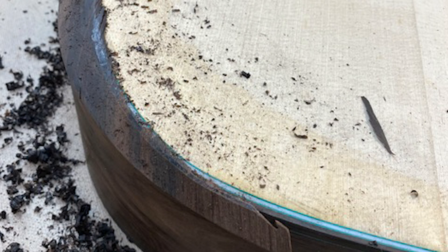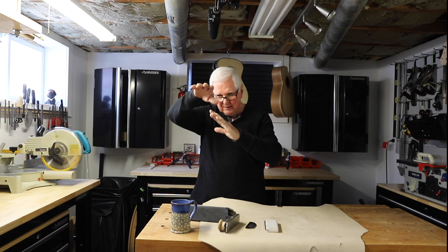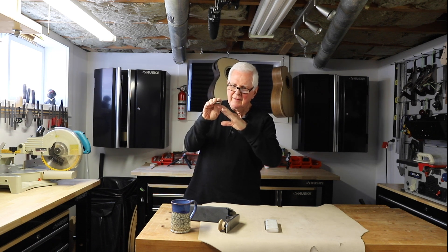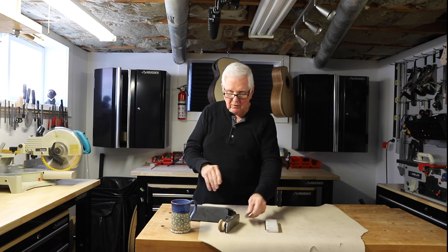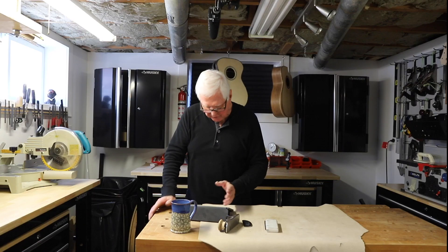Here you can see how the white Teflon is beginning to appear as I shave around it — it becomes extremely thin because it's on an angle and my plane is coming in like this. I'm getting quite an angle on the piece of wood coming up, so it's going to cut down to the top and you've got to be careful. Now look at the very bottom of this photograph — that little piece sitting there with a little hook on it. You want to work on that by going in towards the middle.